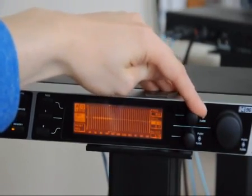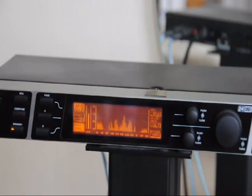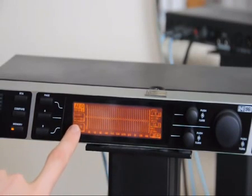So at the moment we're looking at around 30Hz to 250Hz as the area of adjustment, and keep it nice and flat because we want a flat smooth frequency response. Pressing Page again will take you to the next screen. Make sure that room correction is active. Pressing Page again to the third page, you can see Max is set to plus 6dB — this is the maximum level it should apply. About 6dB is correct for most speakers with a 6-inch bass driver or more. Every 6dB boost requires 4 times the power. For a very small speaker I'd say 4 or 5dB maximum, but I'll leave it at 6 here. You can then press Start Auto EQ.